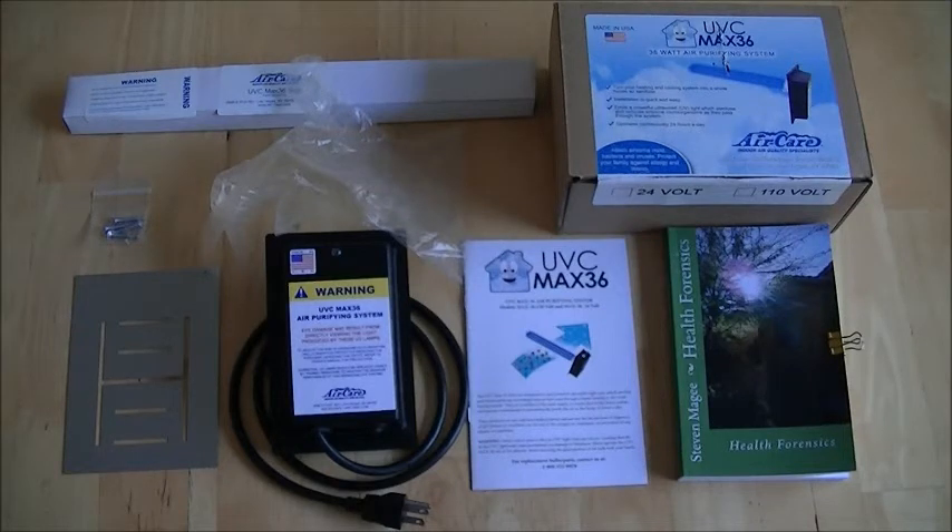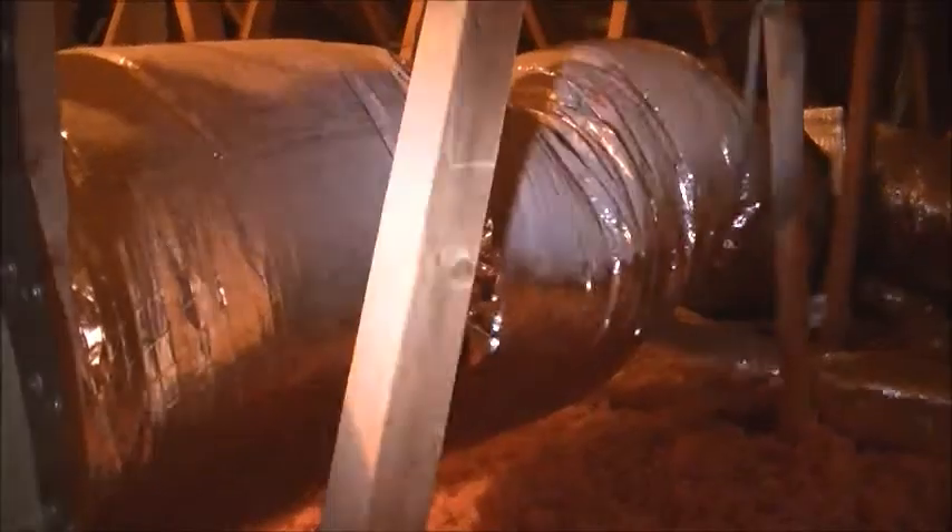Let's go and install it. There's our air conditioning duct, and over here is our cooling box. We've cut the hole for the metal plate, folded the metal plate in, and ensured there's enough room for the UV tube to fit next to the cooling coils. The duct is going off on that side and we're ready to install the UV light.